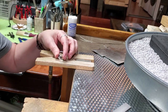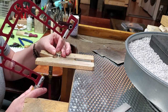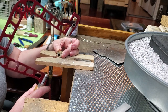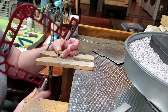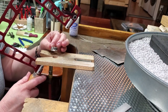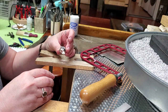It's time again for some sawing and this one is much easier. Take your ring, hold it firmly, locate where that seam is, and saw straight through the join. Depending on how well your ends line up, this may take several passes to get the seam to line up perfectly with no gaps. This will provide you with a much cleaner seam and your solder will flow beautifully. It's actually easier if you thread the saw blade through the ring and work from the inside to the outside, but I went from the outside to the inside. Either method will work.